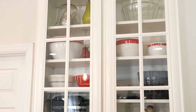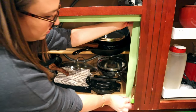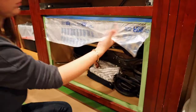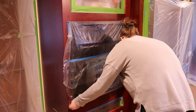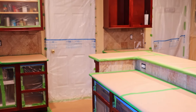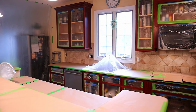You could choose to paint the inside of your cabinets, but in most cases the inside is still in good condition and painting them is double the amount of work in this already large project. We did paint the inside of our two cabinets that have glass doors. To cover them, start by putting a piece of tape along the bottom edge of the cabinet, then put a piece of tape along the inside edge with the sticky part facing out. Then tape a piece of the 3M plastic to the top, unfold it, and stick it to the tape border you created. Add any extra painter's tape to secure it. You can also use this plastic to cover appliances that you still want access to in between coats of paint. Decide on how much coverage you need in your kitchen based on the needs of your project.